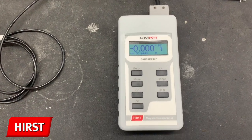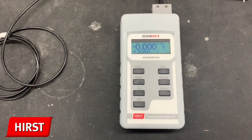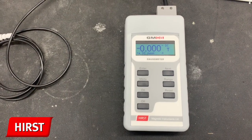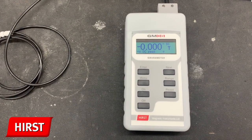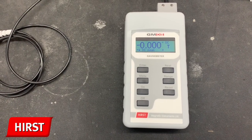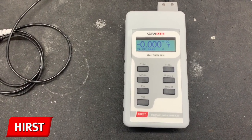Next, DC peak. This function measures the peak positive DC magnetic flux density or magnetic field strength. This reading is updated with increasing measurements. Once a maximum measurement has been reached, this value will be held until the reset key is pressed.